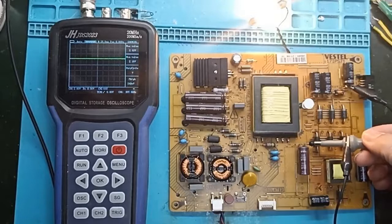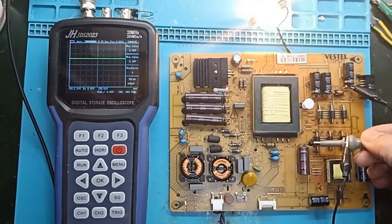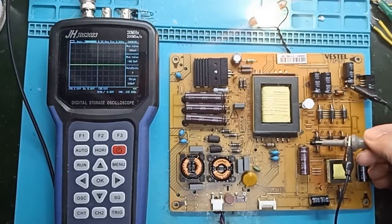I've reconnected the capacitor. This is the waveform that should appear when the capacitor is good — you are seeing a flat straight line, which is the correct DC output.